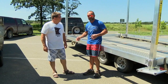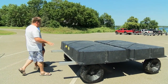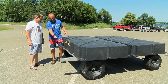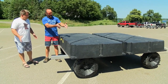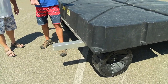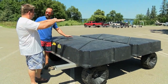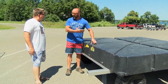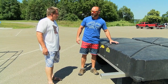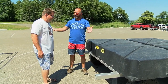If you are the do-it-yourself type and you don't want to wait for us, we have this really cool float and roll product. People can rent this at Lakeland True Value — we rent them, or you can buy them too. This is Flo's float and roll system. As you can see, it has wheels on it. Basically all you do — it extends out for different size lifts, it'll spread out. You put this above the beam of your lift, the main frame beam, and then you pinch it down together with the lifting beam and roll it in. As you roll it into the water, it'll float. So you can use this either to put your lift in and out, or if you need to move a lift to the other side of the dock, it's got cables on it — you could actually pull it with a jet ski or a small boat. I've literally put in a 5,000 pound lift by myself with one of these. I just rolled it right into the water, walked it into place, and then dropped it down.